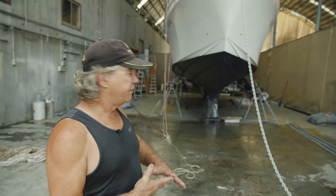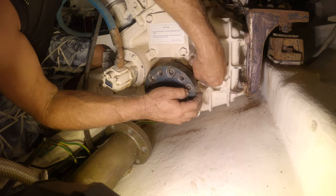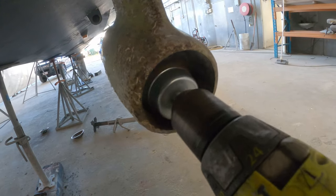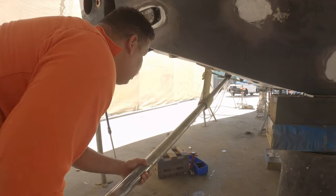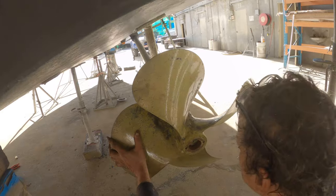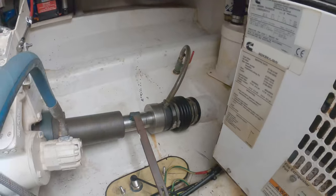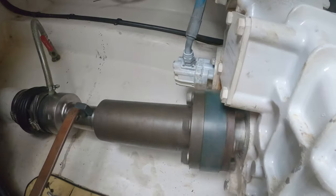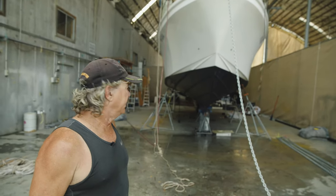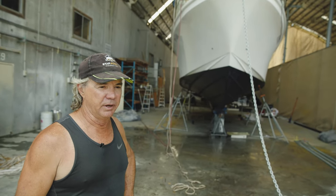Day five. Over the weekend we got all the shafts put back in, the couplings bolted back up tight, rudders back in, and repacked all the shaft and rudder glands. The three-day timeline didn't quite come to fruition — once we pulled her out we found the cutlass bearings needed replacing. It all blew out a little bit, but I'm pretty happy with what we achieved.